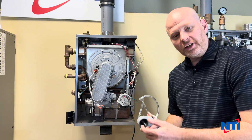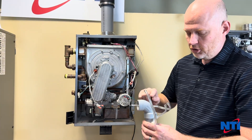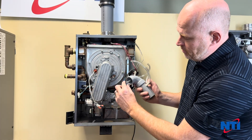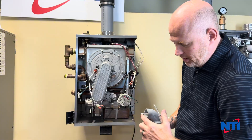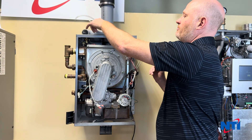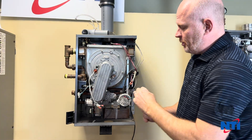If that happens, when you reassemble your boiler you'll get an ASO error code. So if you're getting that error, pay attention to that tube. This really only applies to black elbows. For all the ones with the aluminum tube like this one, just make sure it's nice and centered inside — it should stick out about an inch to an inch and a quarter past the face of the elbow.